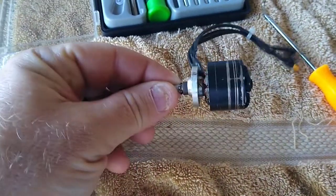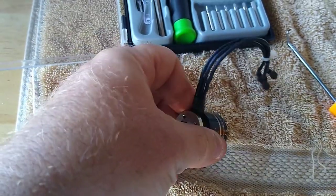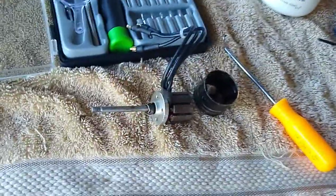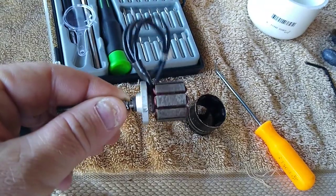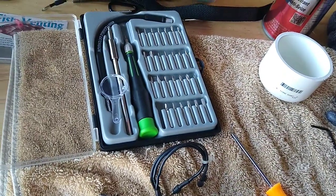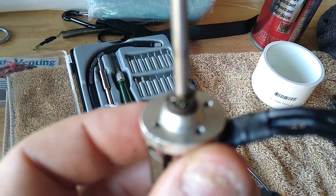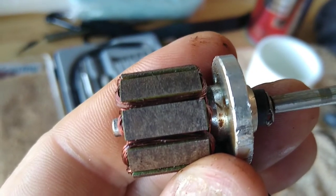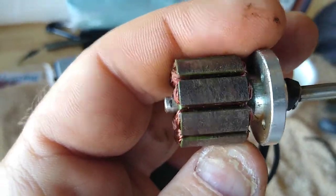This motor was not sprayed down — or it was, but it was a little too late. That's not decorative coating, that's rubbing from the inside. It's a pretty strong magnet around the windings. This is a brushless motor — what that means is that when electricity is applied to your windings, it'll cause it to rotate around these magnets in here, and that's what gives you your power. Corrosion has gotten into that bearing right there. I've cleaned this up a little bit, but corrosion got all around in here — you can see some of it down on the disc there. All of these were corroded up. That Corrosion X will help stop and prevent that.